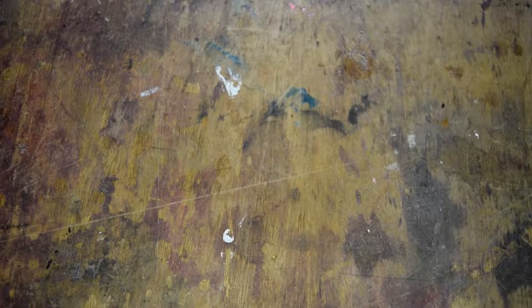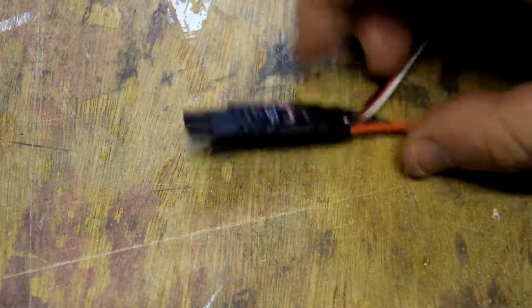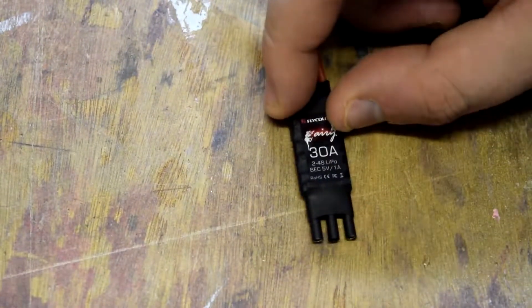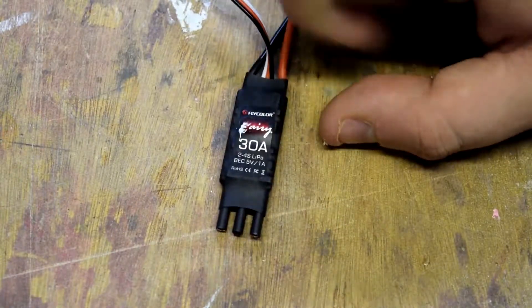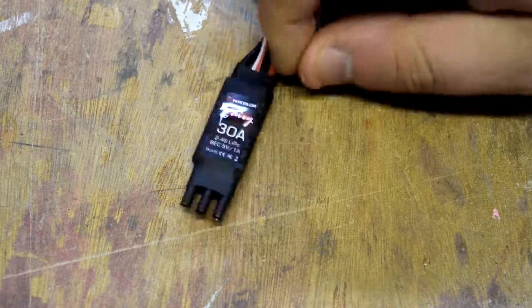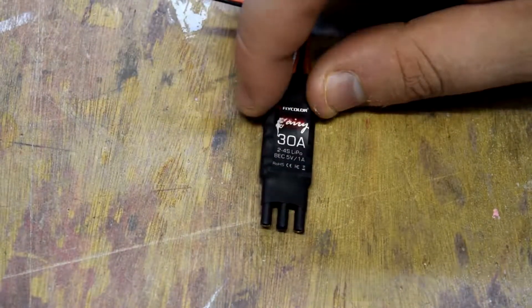With this being a plug and play, you do of course get most of the electronics in the box. Something I was not that impressed about, and it's been brought up by other people, is the ESC that comes with the NanoTalon. It's a 30 amp Fly Color ESC with a 5 volt 1 amp BEC. I think the voltage is more like 12 to be brutally honest. It's a multi-rotor ESC - I'm not that bothered about that - it's just the amperage. I don't like that it's only got a 1 amp BEC.